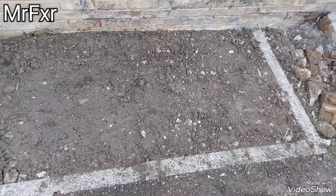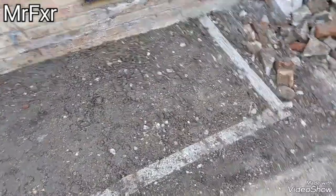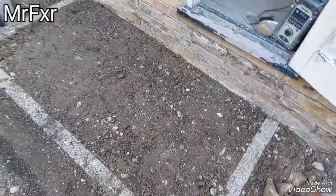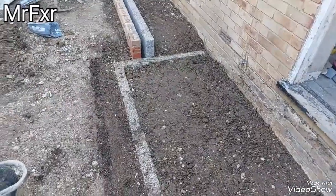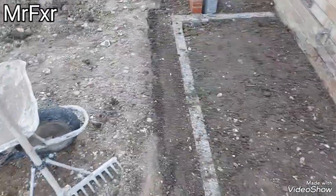within the shuttering. Gonna make sure that it's at least 2 inches from any external edge of the concrete, so it's gonna be well within the concrete. I'm gonna run it about 3 inches off the floor, 3 inches below the surface, 3 inches in from the ends, because you don't want any moisture to go into the rebar and blow it up. And there you go. Yeah, that's pretty much it.